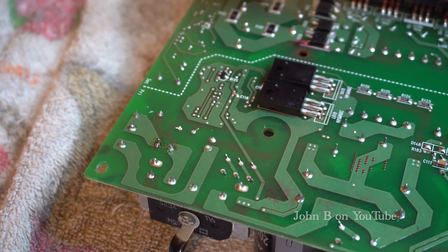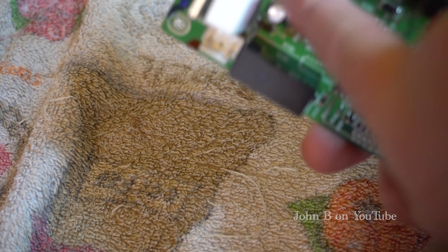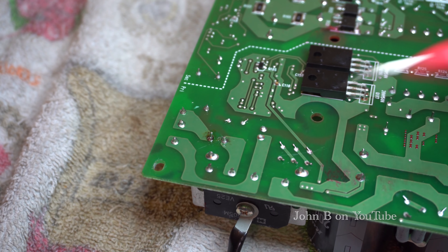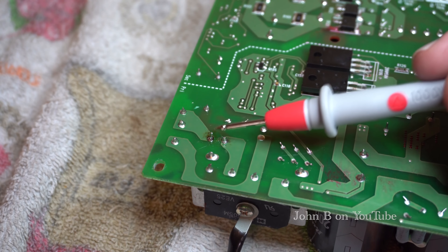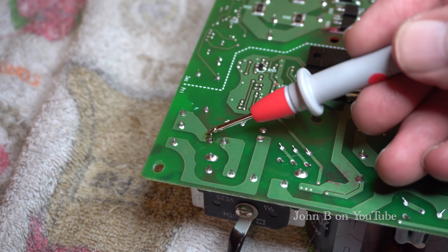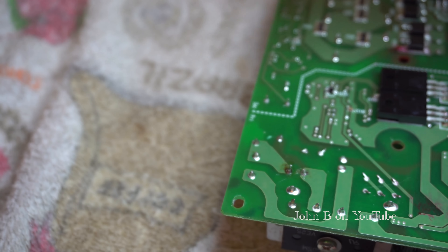Two minutes later, I've just taken that board off. There's that resistor. But if I bring the light over — look at that — someone's been at that. And I repair these for a customer. Someone has already unsoldered it, or maybe replaced it and not checked these FETs — these are the short circuit ones. So if something goes short circuit, something has to give. I'm surprised that none of the drivers for these were blown up. That's what usually happens on the Mackies. Maybe these Yamahas are just better built. But this looks like — well, you can see fresh solder on there. Someone's been at it, and I hate that. It's not even tidy soldering.